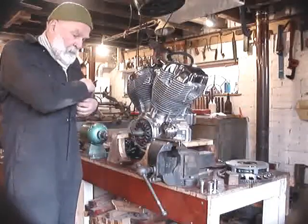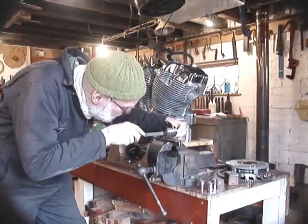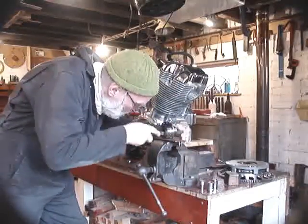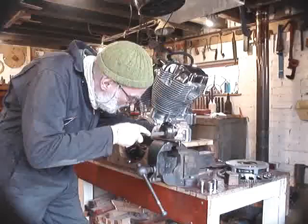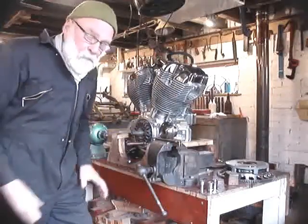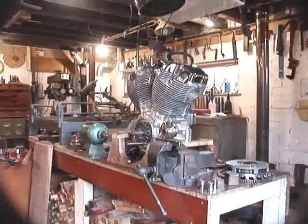Now this is where I've got to get my glasses on. I'll have a good look in there and I can see just at the far end. And that's how I'm going to continue until I've done it — I'm going to pull them all the way around, push it on the spline again, get some marks further in, file those out until it goes nicely all the way home. I'll catch up with you again later.